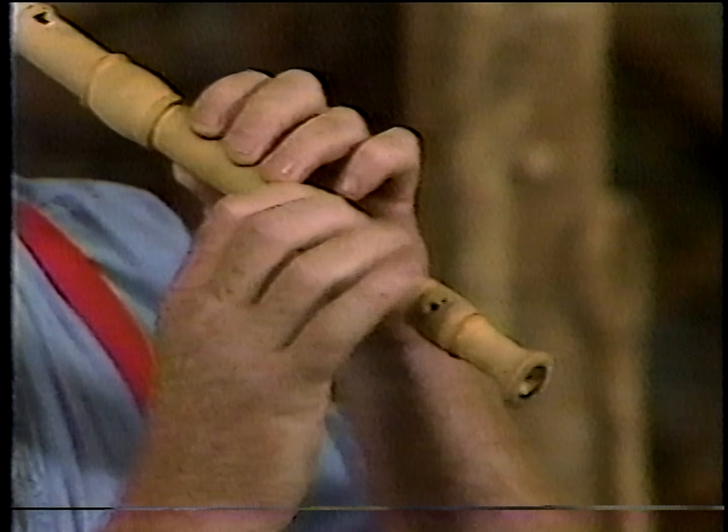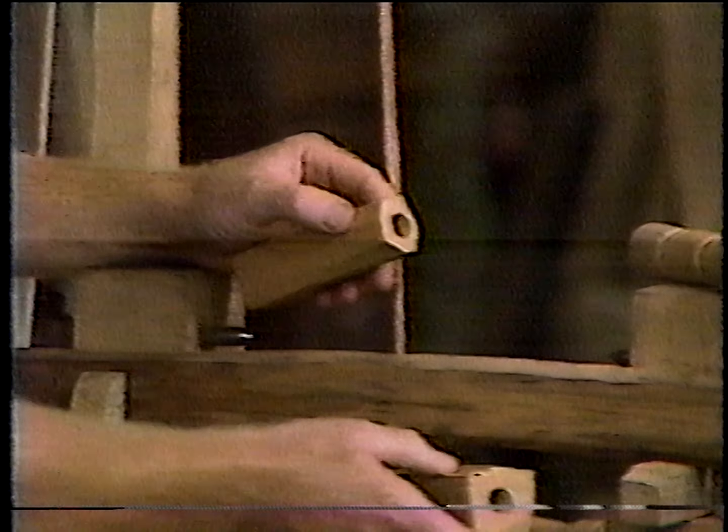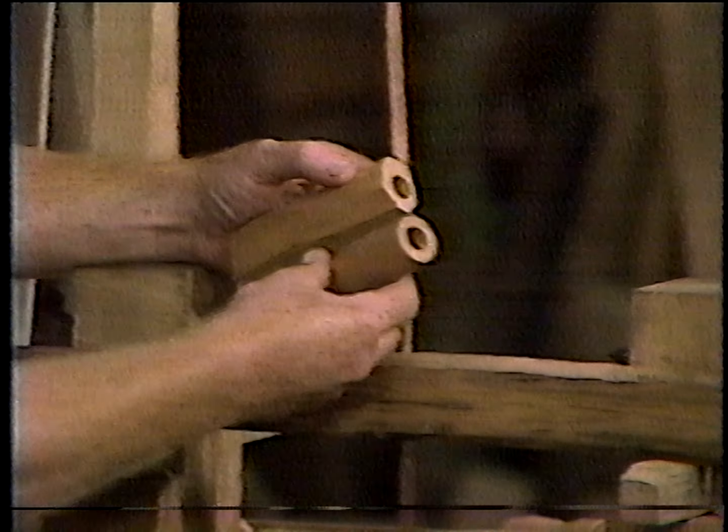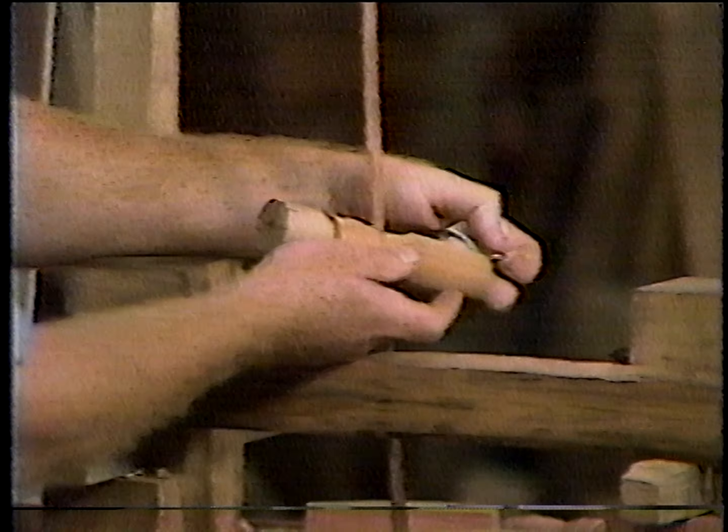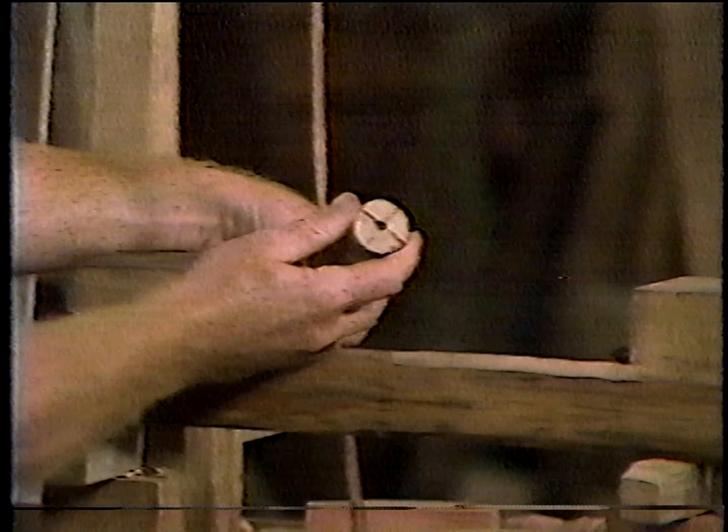There's another kind of auger, as you'll see when we bore the foot, that's actually preferable. Let's take it over to the lathe now, because this is a turned item. We are turning this on the lathe. How are we going to fit this in the lathe? I've got the spring pole lathe here. The reason we bore these holes first is you can't tell where they're going to come out really, so you start with them as your center line — they form the axis of the piece. You then fit it in the lathe and turn concentric to those holes.